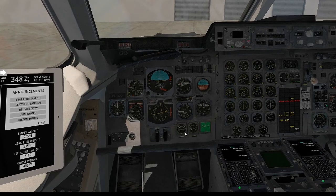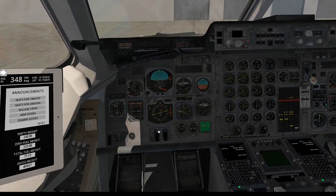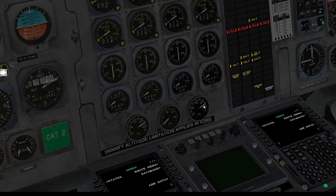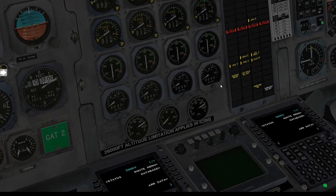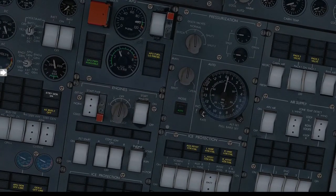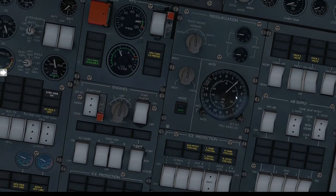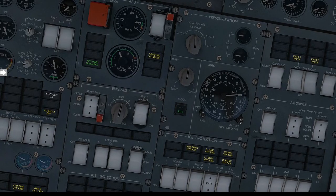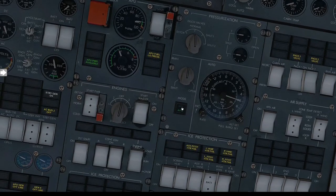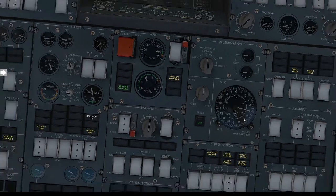That is the first part of flight deck safety set up. Before start — we'll continue through our checklist. Safety exterior checks are complete. Yellow park, press and temp — we've turned that on. Fuel is off, hydraulics are all off. Fuel panel is checked and set — we can see we have enough fuel with nothing in the center tank. Now we go to pressurization. The pressurization control is here. We need to change the rate — we've been cleared to 22,000. We'll set it to 23,000 to avoid any blackout issues. It's on automatic. The valves are currently shut but will open as we get ready for taxiing.